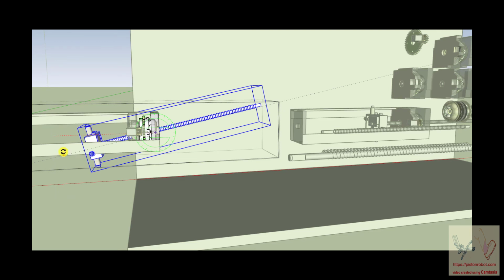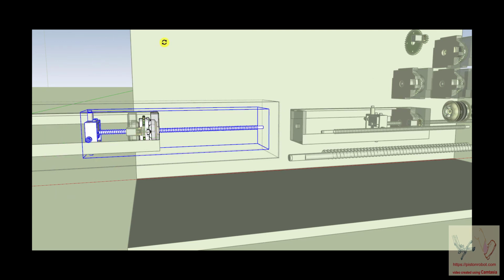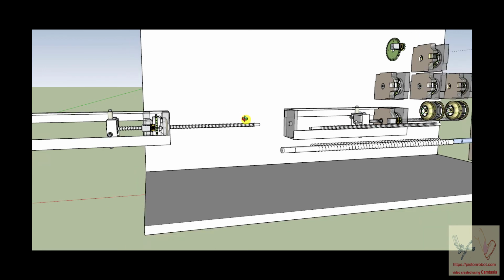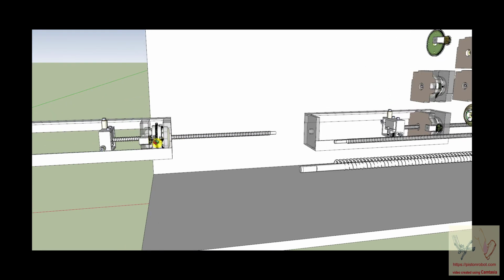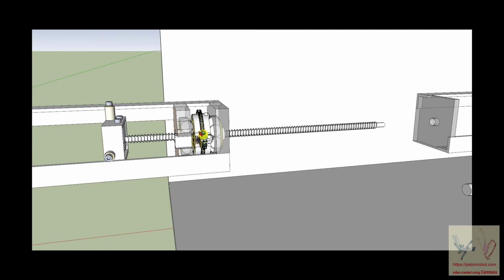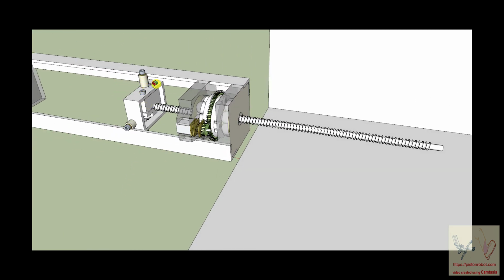Both of those two axes of motion, of rotation, for the hydraulic cylinder are what we're calling the equivalent of a hydraulic cylinder. For it to distort itself and bend, those are prevented because you have anchored the ball shaft in here, inside of the ball nut, so that's one support position right here. And the other support position is right here, and this thing, not only can this not turn, but it can't go up and it can't go down, it can't go back and forth.